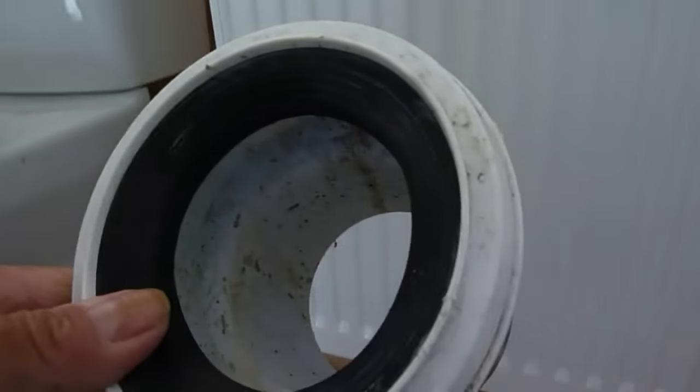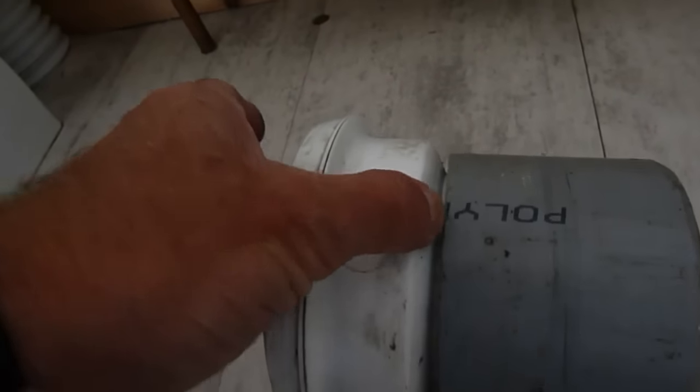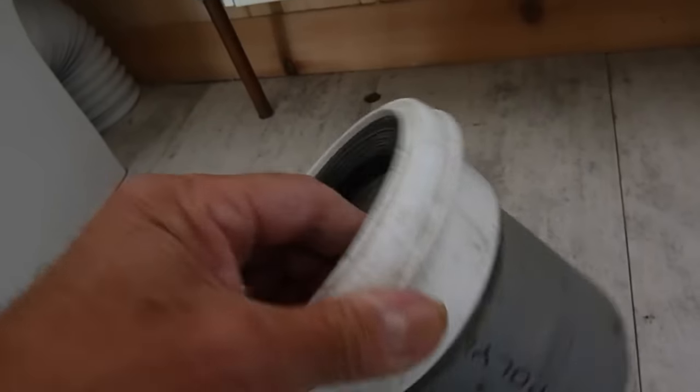But quite often it's not that case. Quite often what it is is this multi quick joint - they call them that - this joint here that I showed you. Now this one specific type of mine, it's one of the long flexible ones, but quite often this is the one most people have. And there's your soil pipe - I've cut this one off some time ago, but there would be your soil pipe and this would be the multi quick joint that's pushed into it normally.